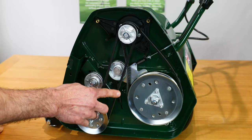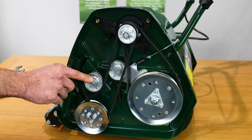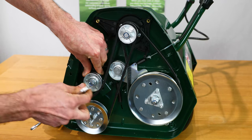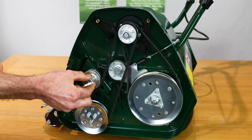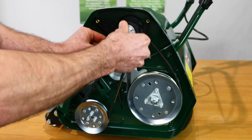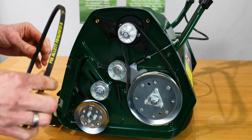First we'll start with removing the cylinder drive belt, which is this one here at the front. Note the mid tensioner — what we want to do is loosen the M8 nylock fixing from the centre. This will allow us to take all the tension off the pulley, and the tensioner will move within a slot on the chassis. We can then remove the belt from the pulleys and inspect or replace it.